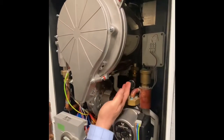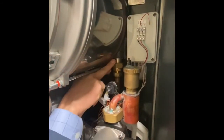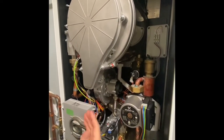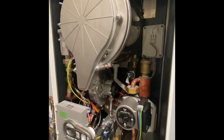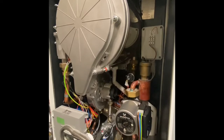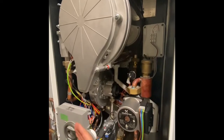This is a stainless steel and titanium hybrid heat exchanger — a one-pass design with a full one-inch tube in the back, ovalled on the inside to create a flow pattern, running counterflow from back to front and out the supply. It reacts very quickly and is very safe. Unlike parallel water-tube designs, if there's ever an obstruction or scale buildup, the boiler will go off on high limit quickly. On manifold-type designs, if one tube clogs, flow redistributes through the others and you may end up steaming in that one tube, damaging the whole heat exchanger. This single-tube design will detect a blockage and shut the entire system down — very safe, very efficient.